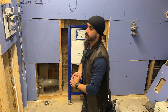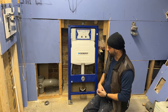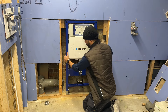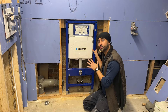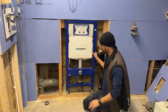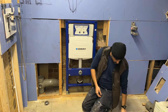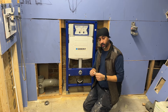The first step is looking at where the soil pipe is. In this particular scenario my soil pipe is behind this wall — that's how I've simulated it. We've actually built the wall forward, so we're not going to be building a box — this is going into the wall. Because it's a side-entry situation it's the least favoured option, but if you've got a huge room you can build a whole wall forward and make it look like a proper wall-hung system. If you've got joists there's going to be some flex in the floor, and what Geberit supply is coach bolts that drive deep into these sections.